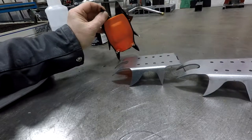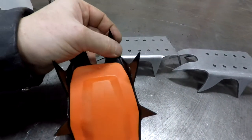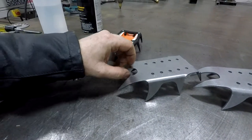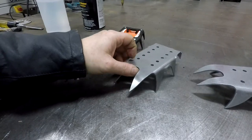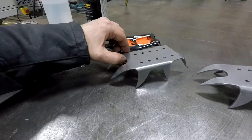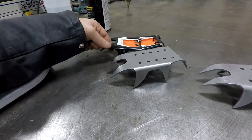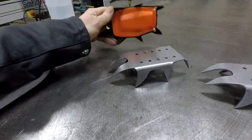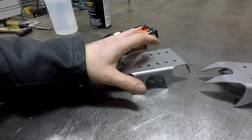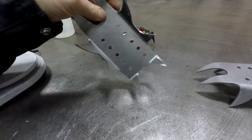I'm not sure what gauge they use on this because it's quite contoured — it's got a roundish contour, so it's hard to really get an accurate measurement. It seems a little bit thicker than 14 gauge. I'm not sure what size gauge it would really be because it's in between gauges according to my measurements. I think it's not accurate due to the die that they use just to make this one pressing, where on this piece I cut it out flat and press it in individual dies to give me the bends I need.